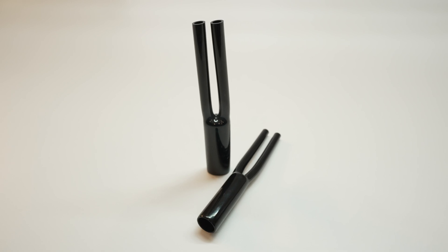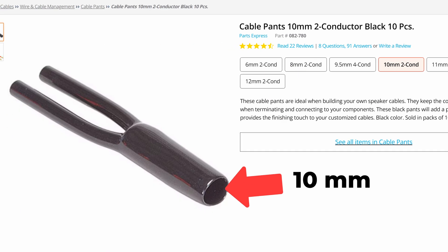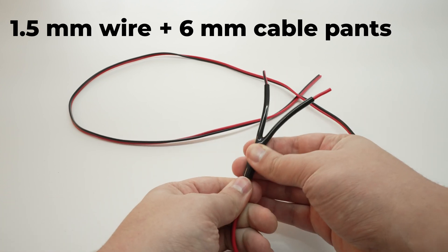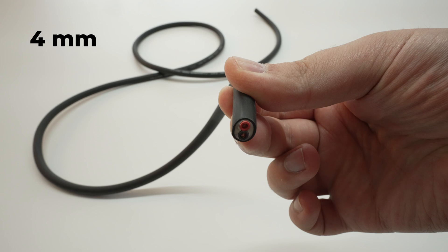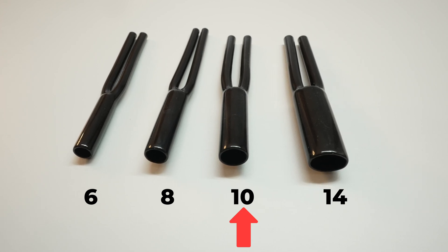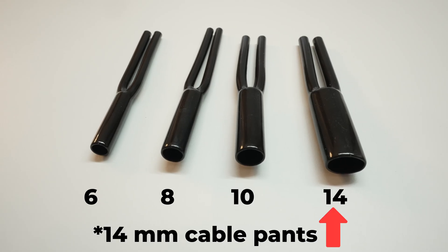The most annoying thing about making these cables is choosing the right cable pants. These have fixed dimensions and are not heat shrinkable, at least the ones easily found in audio online shops. The dimensions you see on the website are the dimensions of the input section — the legs have an unknown size. For example, 1.5mm wire fits the 6mm cable pants nicely. 2.5mm wire with extra insulation, which is 9mm in diameter, fits the 10mm cable pants quite satisfactorily. However, 4mm thick wire with 10mm extra insulation fits the 10mm cable pants but the thicker individual conductors won't fit through the legs — I even tried lubricant, it won't go through. As a result, if you want to use 4mm thick wire, you need to use the 14mm cable pants.